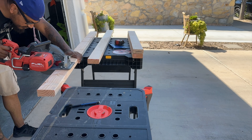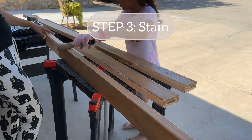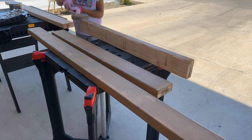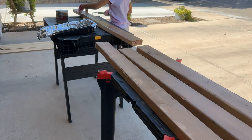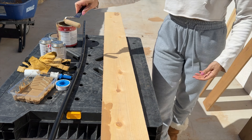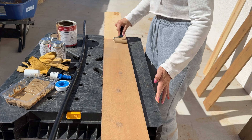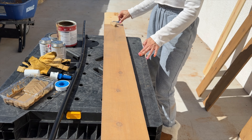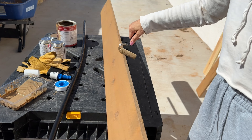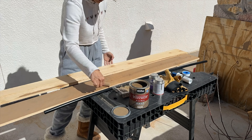Use your resources and ask around — ask your neighbors, friends, or family if you can borrow their tools. Step three after cutting: you want to stain all of the wood pieces and the cedar panels. My daughter wanted to help, so I let her. I like using a tiny roller — it goes on smoother. Foam brushes discombobulate pretty quick, but even an old rag will work. I went with the colored tugboat stain. After applying the first coat, wait two hours minimum and then reapply the second coat, or follow the manufacturer's instructions on the can.